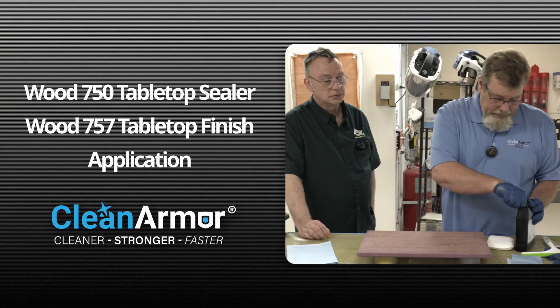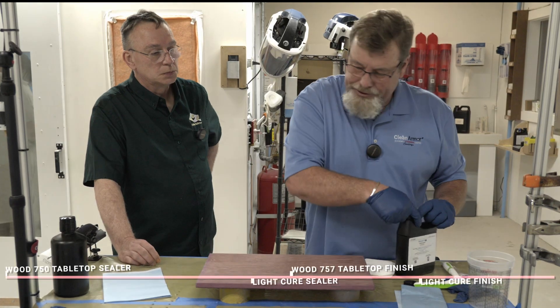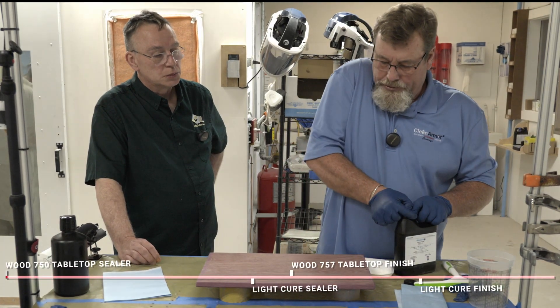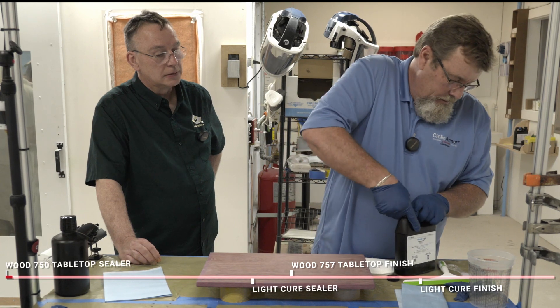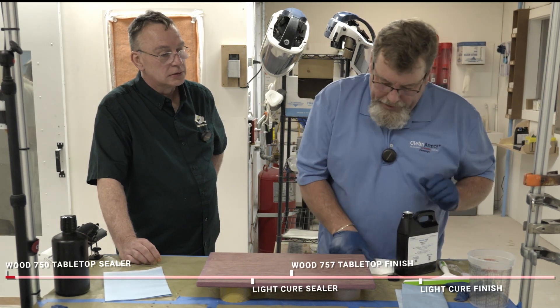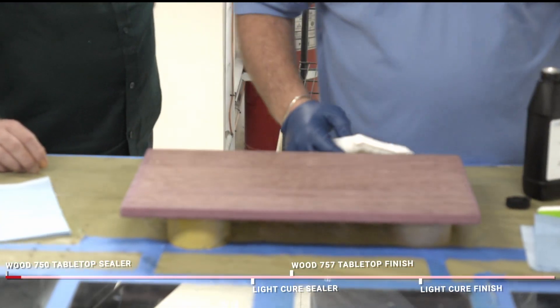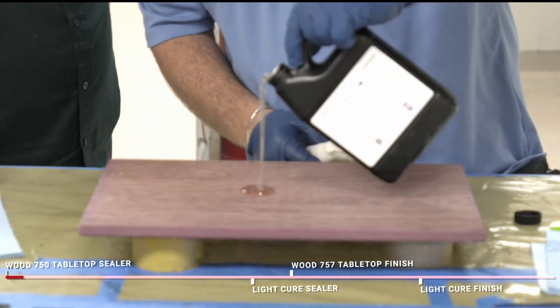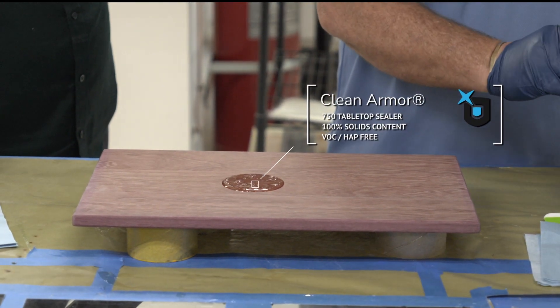We'll take a sealer. This has been pre-sanded and scrubbed with our airbrush this morning, so our grain is empty and it's a very nice fresh piece of wood — it's ready for preparation and finish. I originally sanded it down to 320 already. So we'll use a little bit of that.